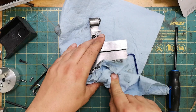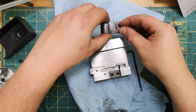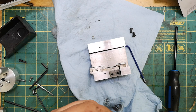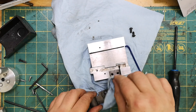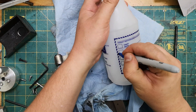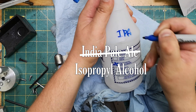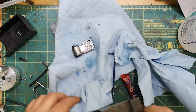The reason we're doing this maintenance is just to clean out the slot that the nut interfaces with, loctite the screws, and retighten them. I'm also going to add some shim stock when everything is aligned. You can see that because the nut interfaces with the slot, if there's any clearance between the slot and the nut, the nut will simply rotate until it takes up the clearance before it starts feeding the axis — this results in increased backlash. I went through pains to ensure this machine was fully oiled, but I have to remove any oil before I can apply loctite, so I'm using lots of isopropyl alcohol. Solvents can still leave a thin film of oil, so lots of solvent has to be used to make sure all the oil is gone.